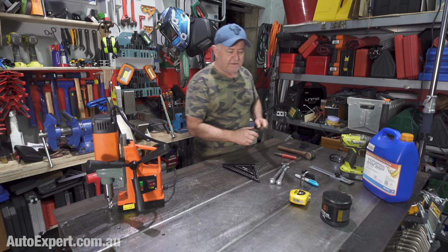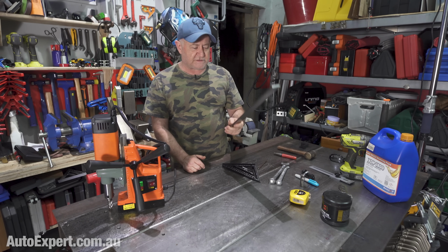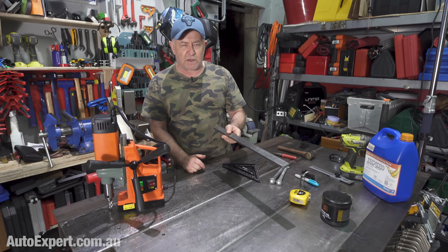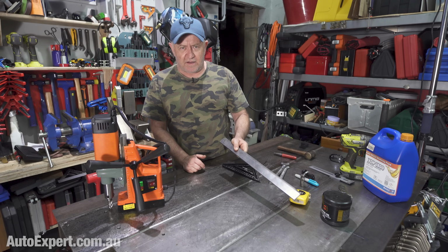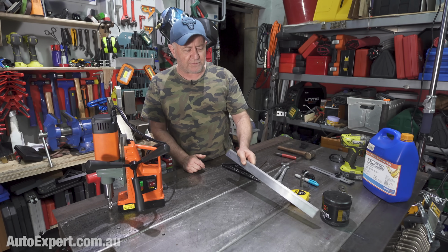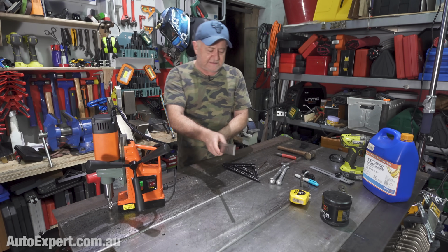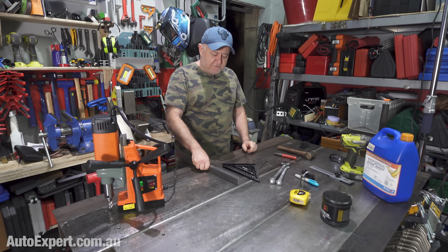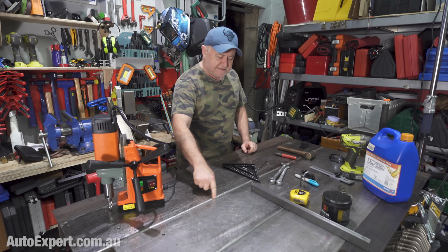These 3 parts here, right? They're pretty flat. This looks like a ruler, but it's actually a precision instrument. It's like a proper precision ground metrology type straight edge. I do treat it like crap, but it's still pretty straight. These 3 bits here are nice and straight, and these 2 bits here are nice and straight as well. But unfortunately, there is a valley just here.